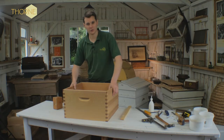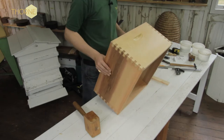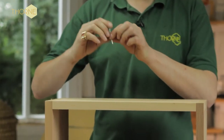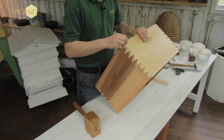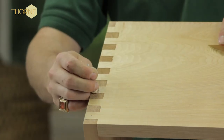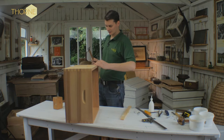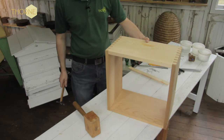So now you've got your brood body pushed together, the first thing to do is start nailing. You take out of your pack of nails your two-inch lost head nails and we're going to start off from each end — one at the top, one at the bottom. This particular one I angle downwards, just to avoid the rebate on the inside wall, so I angle that down.